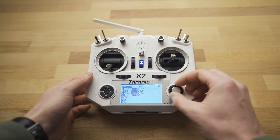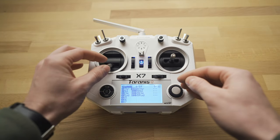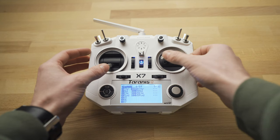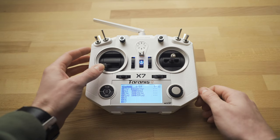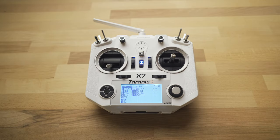This is going to be the input setup. You can see there are already four presets in there for the throttle — up and down — your aileron which is your roll (side to side on the right stick), your elevator which is pitch forward and back, and your rudder which is yaw or side-to-side panning. Those are all set up for these switches.